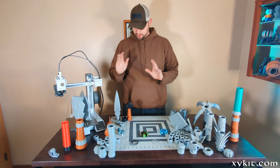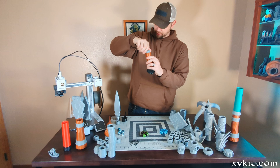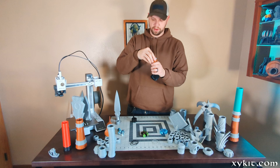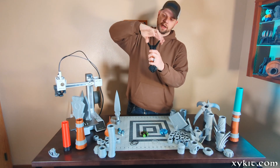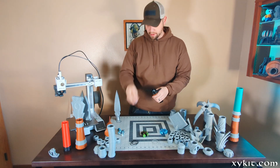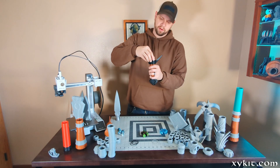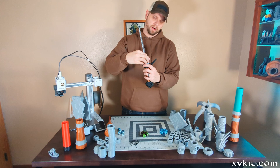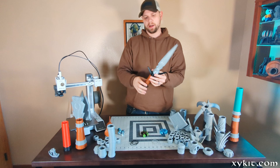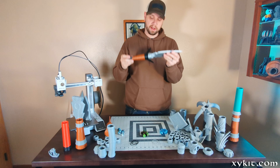Let's build a simple dagger. I've got a handle, a screw, and I already had a washer here, but I know this will need one washer and this will line up the guard with the handle. Now I'm going to put in another screw — same thing on the top, I'm going to need washers. Both of these washers are 0.4 millimeters, which works very well on my Carbon X1 Bamboo Labs printer. You can see the pieces line up using those washers and you get a nice solid screw fit for a dagger. That's why you want to use the washers.